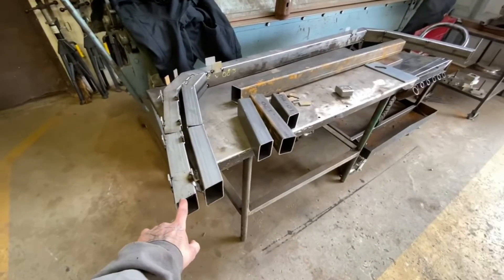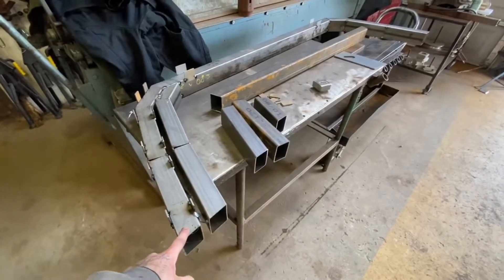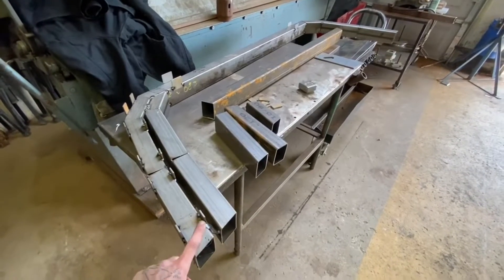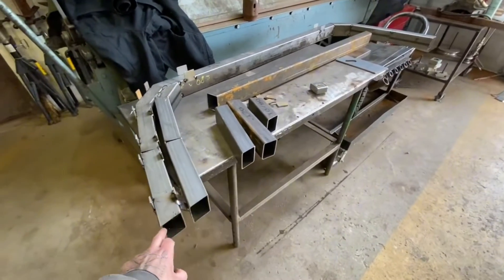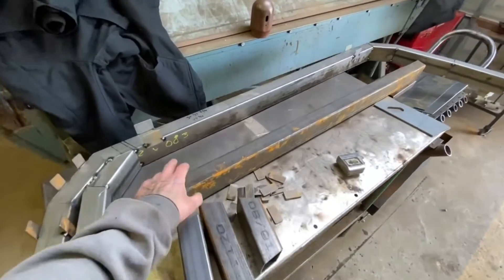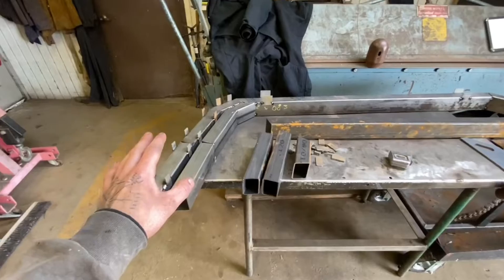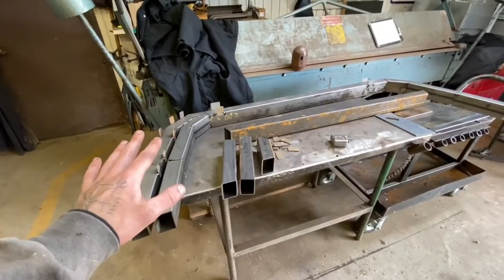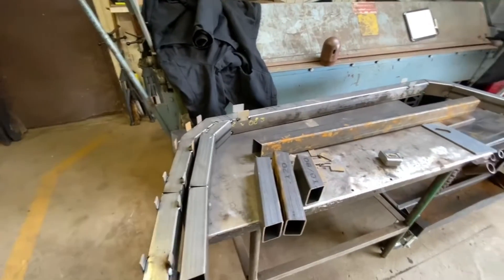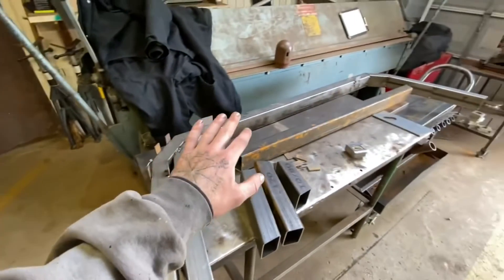When I do this I use a thinner wall material so that I'm not spending as much money, because you're going to have to order extra material for whatever your jig or fixture is made out of. So you're better off using a smaller material — for example, this is 14 gauge, the thinnest wall I can get in 2x3. Our main parts are 1/8" 2x3. I've been building jigs this way forever. This video is just going to talk about doing them in a two-dimensional plane where you don't have any uprights. Basically all you need to do is build one on a good flat surface.